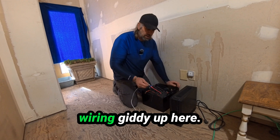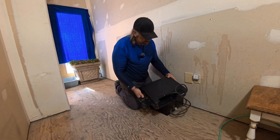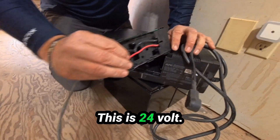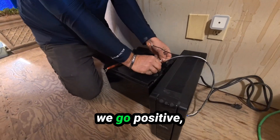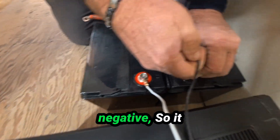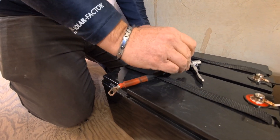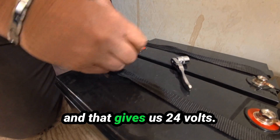What you're gonna do is — see, I made this little wiring setup here. This is for the batteries going in here. You got your two batteries that go in there. They plug in here and it comes with another little connector so you get your 24 volts. This is 24 volt — that just plugs in there. We bring this over, hook it up to this, going positive and negative across to the other side. These are 12 volt batteries, so what we're doing is hooking our positive to our negative, and that gives us 24 volts.